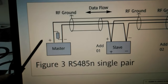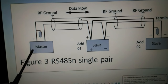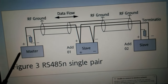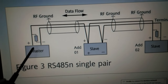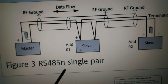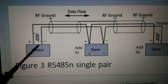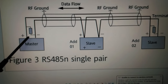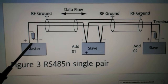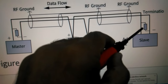With RS-485, as we can see from this sketch, we have two wires and the master is polling the slaves. RS-485 allows multi-dropping, so it can have more than one slave pulled by a single master. Every slave will have its own address. An important component to consider when connecting RS-485 is the end-of-line termination — we need two of them: one at the master site at the beginning of the bus, and one at the last device.